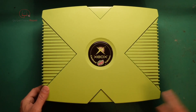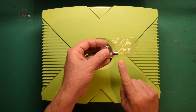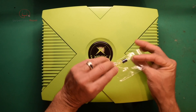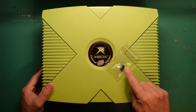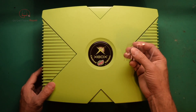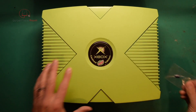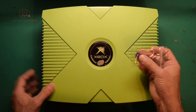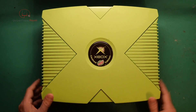Only a small number of these in circulation. The thing about this console in particular is that there is something called a clock capacitor. This is how they keep the time and date saved when the device is unplugged, and unfortunately the component they used during manufacturing is not rated at very many hours — I think it has like a max of 2,000 hours or something like that. These capacitors tend to basically explode on the inside and leak all kinds of crap all over your motherboard, so that becomes an issue.